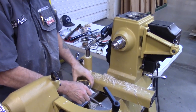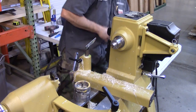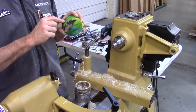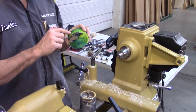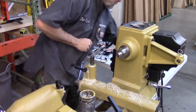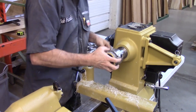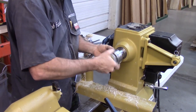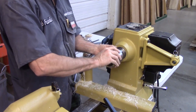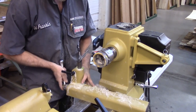Yeah, you went far enough. If you're doing a hybrid blank, at this point, I would have flooded that wood line with CA to literally help strengthen it. You can also use a jam chuck if you prefer. It's just about as abusive as this. I used to make them with just a wood jam chuck and jam it on it, and that works too.